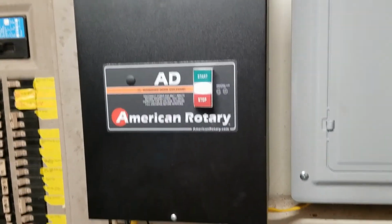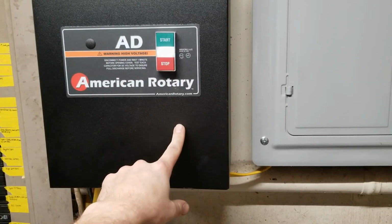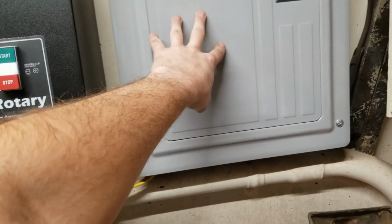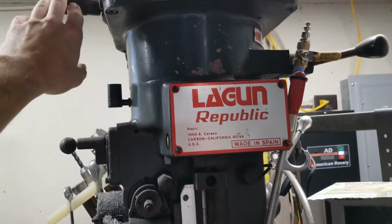It's that simple. Now the motor's out there spinning off of our 2 legs that we had coming in, making the third leg that came in from the motor. Now we've got 3-phase to our panel, going through the breakers. Now to our machines. That's simple.